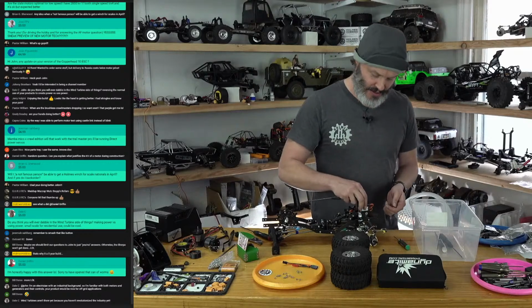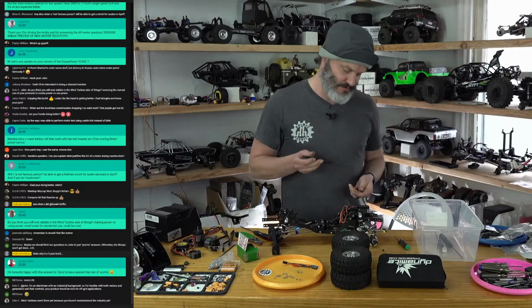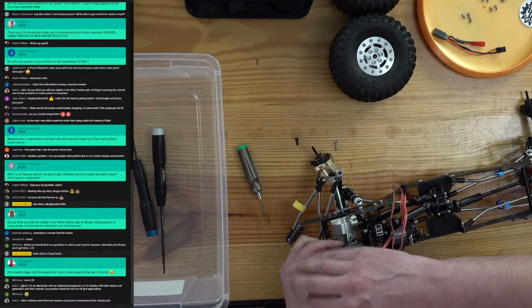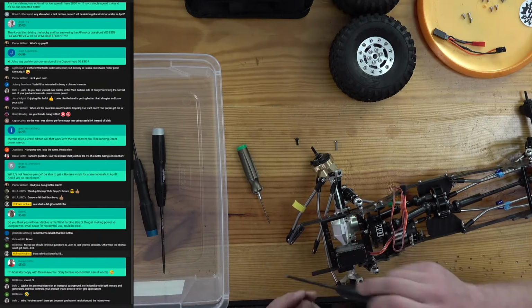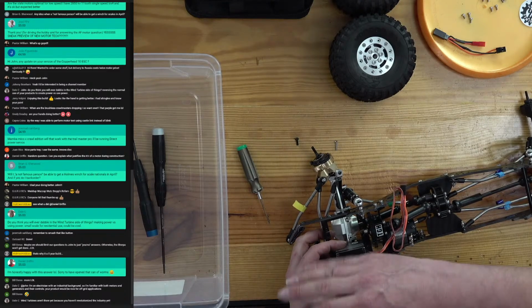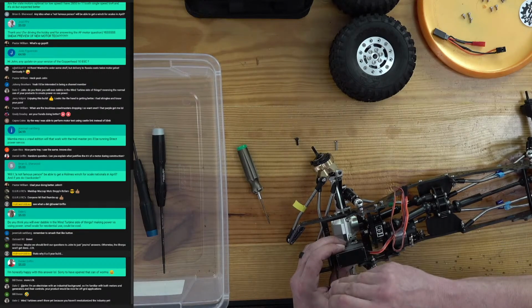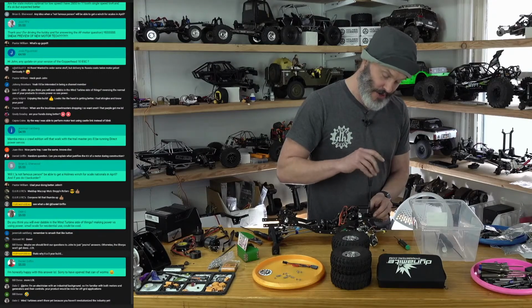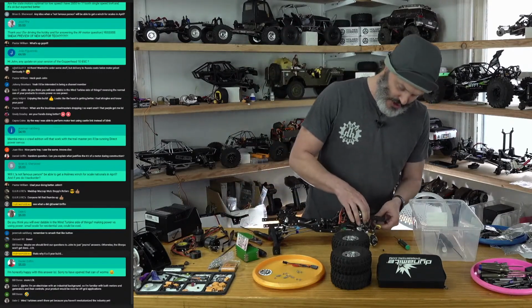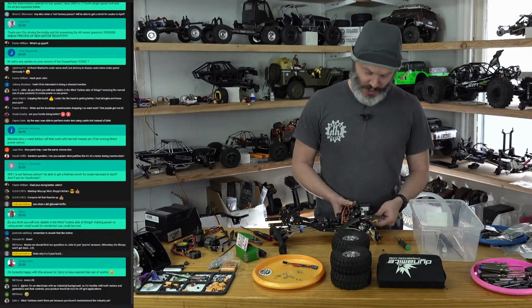I would love to see what would happen. Let's say we had a motor that was KV'd low enough so that we could use 500 volts on it or 1,000 volts on it, but you only had 500 volt insulation on it, which is the standard that we use for our motors: single polyamide coating. It only has a voltage resistance of about 500 volts. If you powered it with 1,000, you'd probably have to put like 5,000 volts on it to really get it to jump. But if you did that, boy, it'd be a fun show at least.